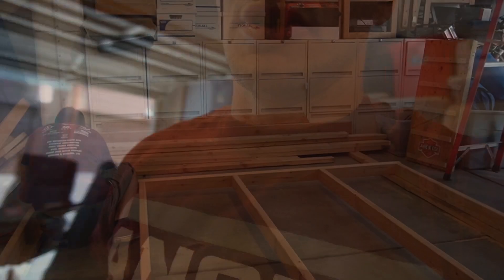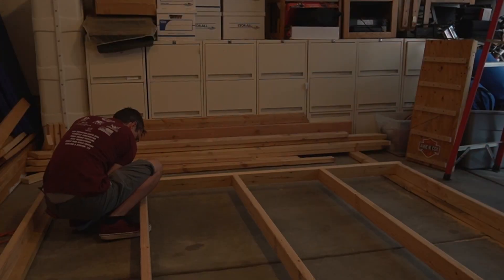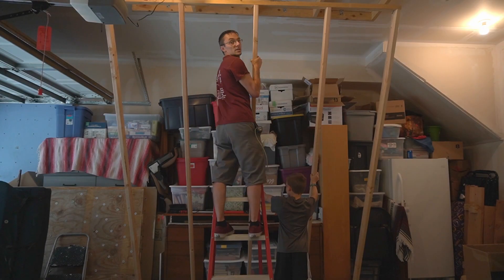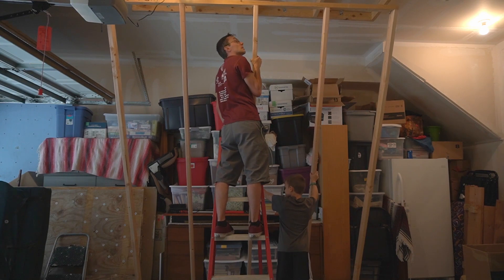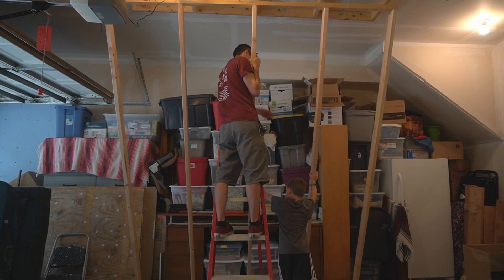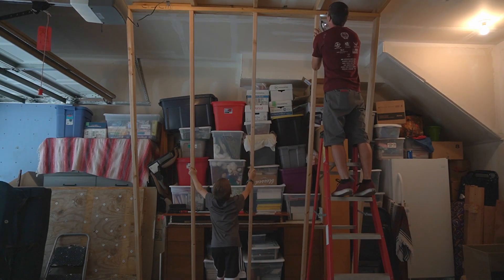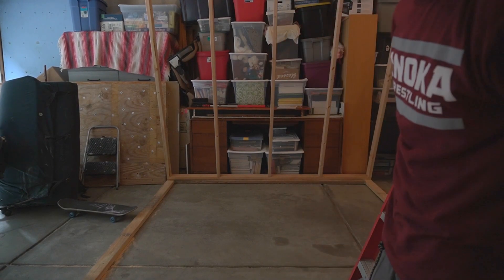So that they're ready to go — that way as I'm pushing this up, they're just ready to finish off and screw in. I'm just going to get them all prepped. Alright, so now we're raising this wall here as you can see. I have my helper. Alright, so now that the tops are in, we're going to screw the bottom in to the base plate.